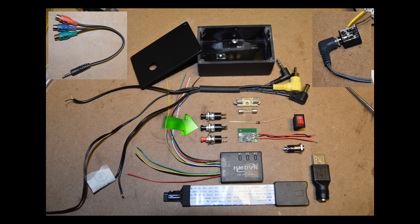Three normally open momentary push switches. A small on/off rocker switch. A fuse holder — the 5 by 20 millimeter type — with a 200 milliamp fuse. And a 1 watt 4V7 zener diode.